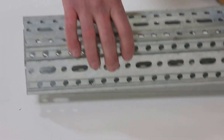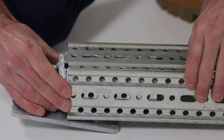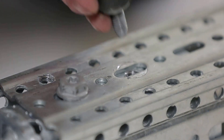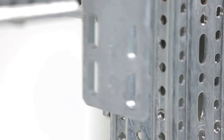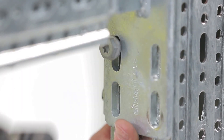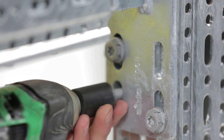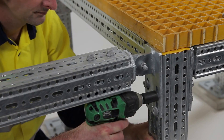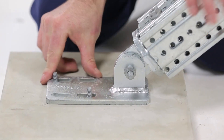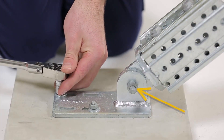Stairs can easily be constructed out of Framo 80. Pivot joints are used to form the stair stringers. Ensure a 13mm gap is achieved as detailed in Chapter 2. Once the stringer is assembled, secure the upper pivot joint to the column, ensuring the pivot joint is flush with the top of the frame. The lower pivot joint can then be bolted to the concrete pads. Lastly, tighten the pivot joint bolts.